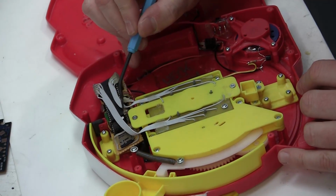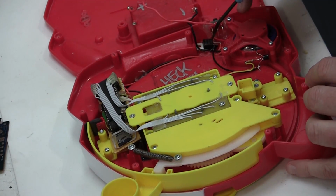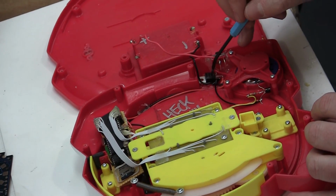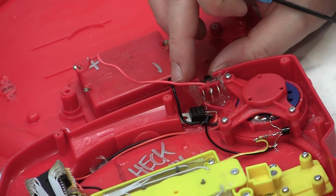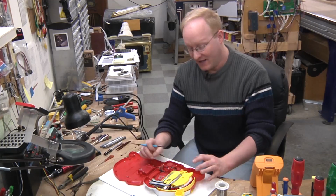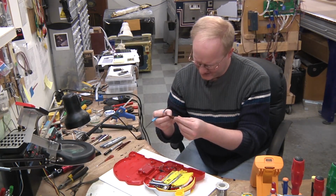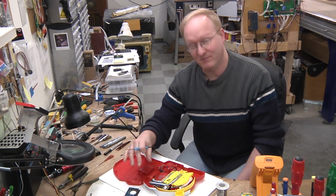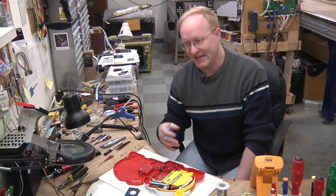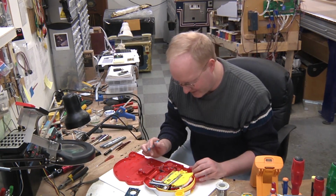We have our power source here. I've tucked it down here to make sure there's room for the batteries. We have a 3.3 volt linear low dropout regulator. We have our normal 3 batteries that came with it. I added a switch, basically so we can turn the whole thing on. This original circuit probably had, oh gosh, there's hardly anything to this. What they probably did was when you complete the circuit, it turns on everything and then plays the sound. Yeah, we couldn't quite do that with the equipment we have, but whatever.